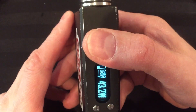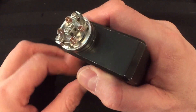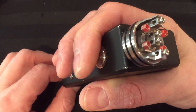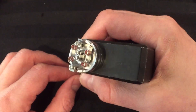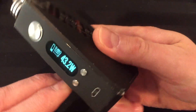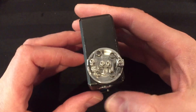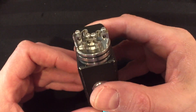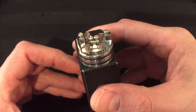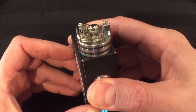Pulsing these coils at 43 watts — as you can see, they're glowing nicely. This is a 24-gauge Nichrome 80 Anarchist wire. Four nice quads, vertical, firing very well. And as you can see, 0.48 ohm resistance. That's a lot higher than it normally would have been if I did parallel, or quads on a three-post or even four-post. So that neutral is doubling what the resistance would normally be on a build like this, and they're firing very nice.